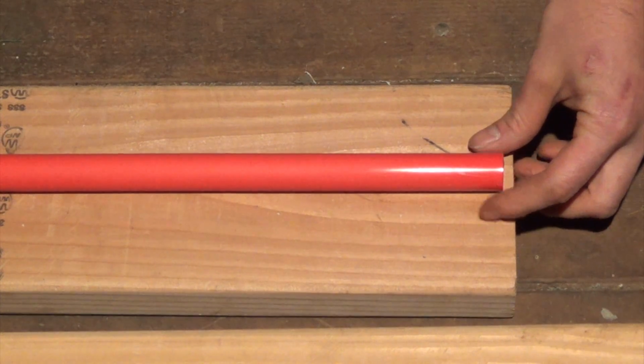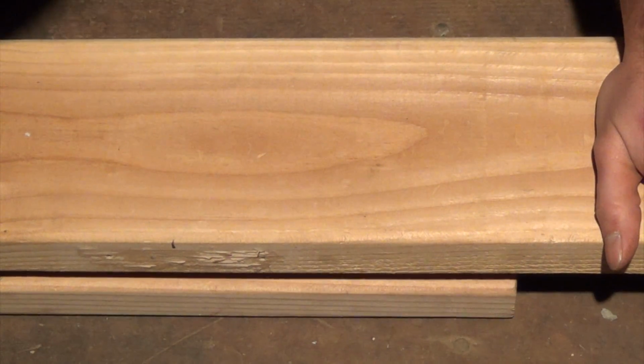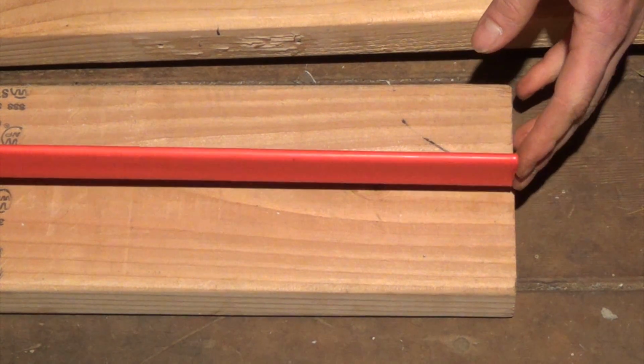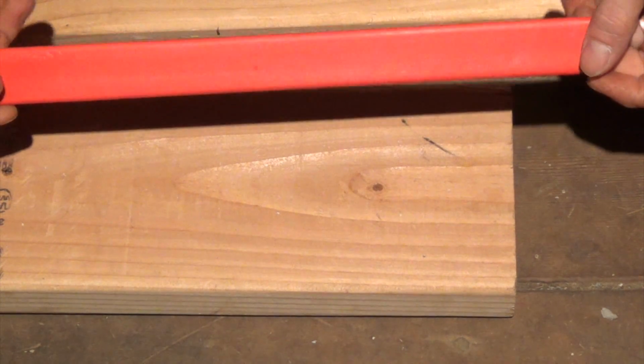To make the trigger lever, we're going to need to flatten the pipe completely. So before I do anything else, I'm going to go ahead and heat up the pipe and flatten it in my flattening jig until it's completely flat. I'm also going to do the same thing to all my other pieces because all the pieces need to be flattened.